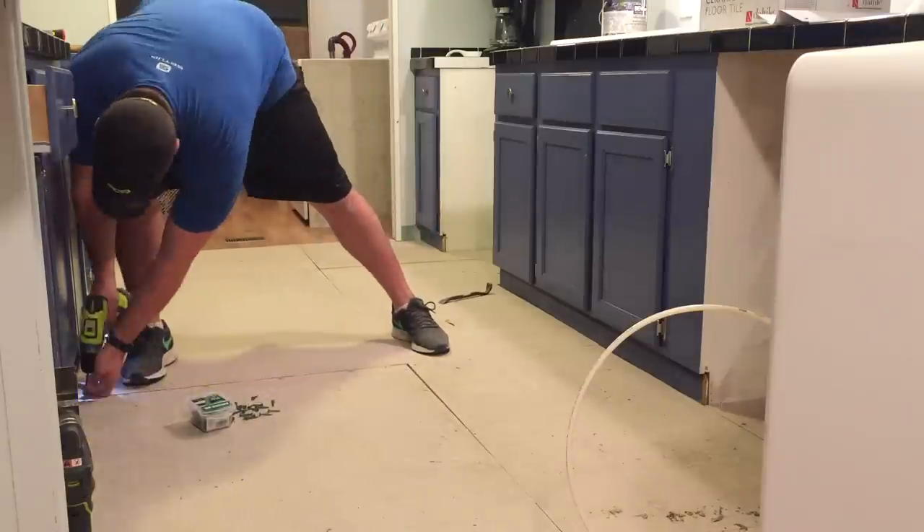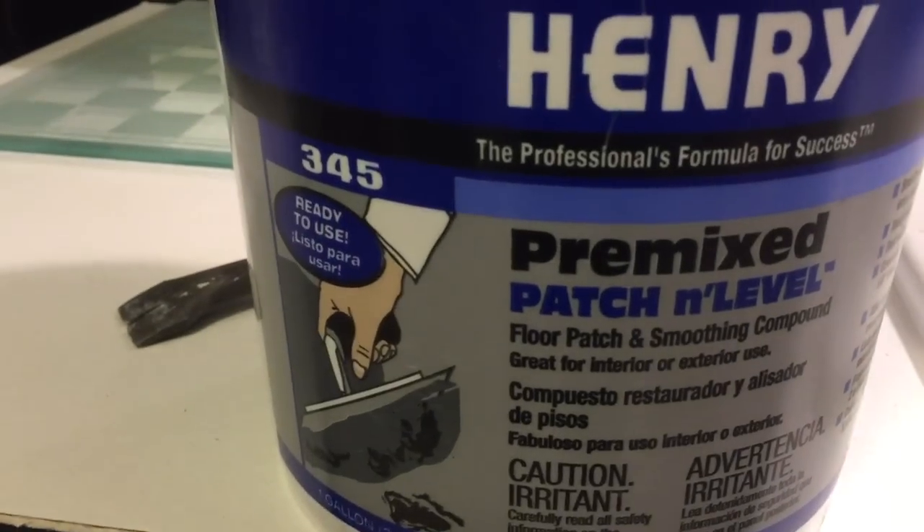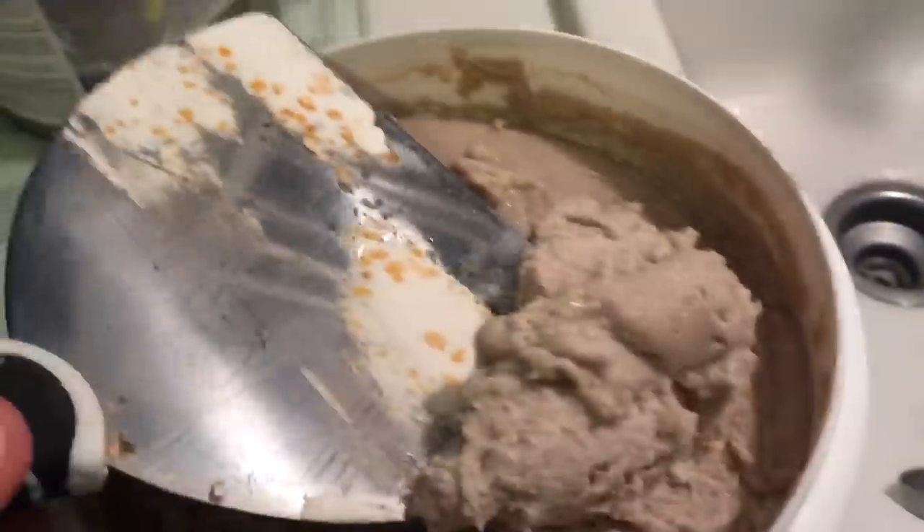It is time to drive some of these screws in. Got all the screws in and this floor is almost ready for tile. The last thing to do is fill up some of these seams — I have a pre-mix patching leveler made by Henry. You can use other products, some kind of rock hard or whatever, to fill in cracks. If this was a bathroom that might get wet a lot, you could add a product called Red Guard — that really coats the floor and protects it from water. Just take some of this and fill in those cracks wherever there might be any.